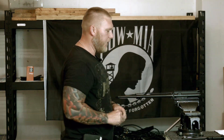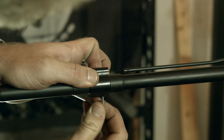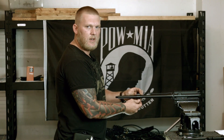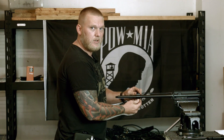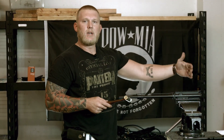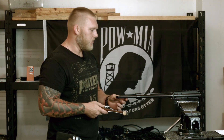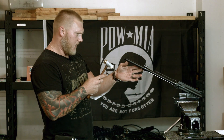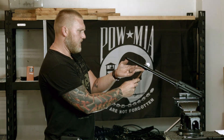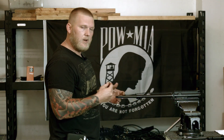When I first initially put it on, if it weren't pinned this would be more of an issue. For those of you at home building your gun, first thing I do is just snug those set screws just a little bit. I don't want to snug it up and dent the barrel and create a memory so the screw goes there every time, because you want to adjust it. Before you tap it one way or the other, make sure you have a lighter color behind your rifle so it creates some contrast — you're going to have to use your eyeballs on this. Eyeball the middle of your bore, track that up with your dominant eye, and kind of split the difference with your receiver. I'm holding and securing the barrel on one side, just going to tap it — now I like it and it's centered.